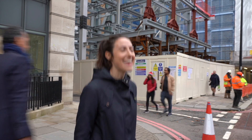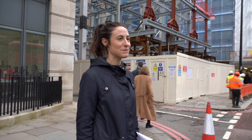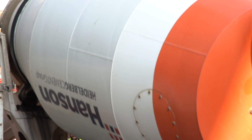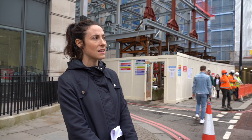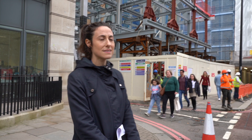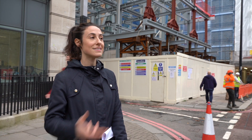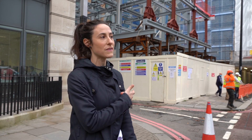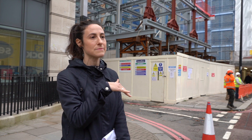Steve Hart and Adam Fox have been helping us with the box-in-box detailing and they've been doing a tremendous effort. I've learned so much about acoustics, and a big thank you because they've basically pulled the project together to a position where we're on site constructing and giving the client what they want. You always need flexibility — we believed we had most of the detailing done, but on site things don't always go to plan. We've had to go back, check things work, adapt, and come up with another solution — in this case regarding shimming and levelling tolerances.